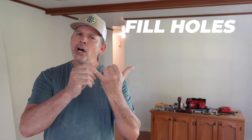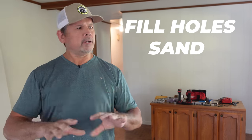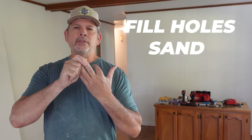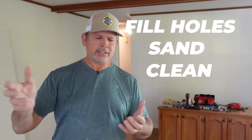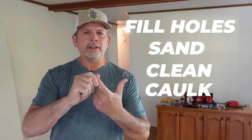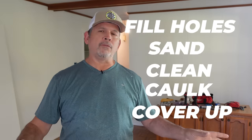So what does prep work mean to us? Well, it's 5 major steps. The first step, you got to fill hundreds of nail holes. The second step, you got to sand all your wood filler and all the imperfections. The third step, we like to vacuum up all the dust that's not collected by the sanders. Then we need to caulk everything, and then cover everything is our final step. Cover all the floors and the windows, everything we don't want painted.